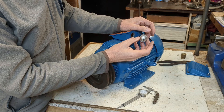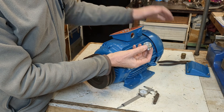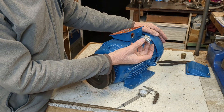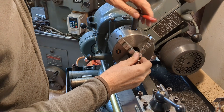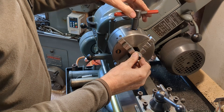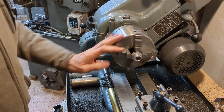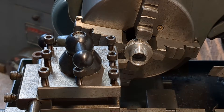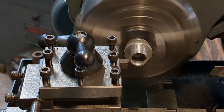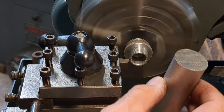I'm sure I can buy these for next to nothing, but it's the middle of the Christmas holidays and I want to use the machine, so the easiest thing is to adapt this. Unfortunately it doesn't run very concentrically — I've tried it in several positions and can't get any better than that. I guess this thread just isn't concentric with the other one. It doesn't matter; I only need to remove a little material to get a good surface to glue it onto.